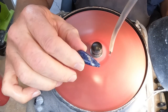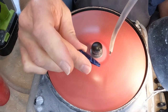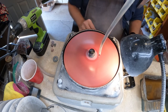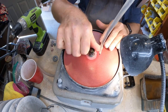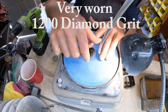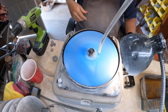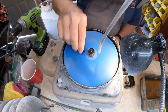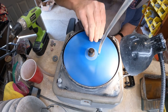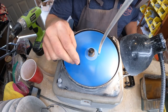And then I'll remove all the scratches. There's a whole lot of evaluating going on here, just making sure that I haven't missed any spots. Now we're going to move to one of the polishing stages. This is a 1200 grit disc and it's worn also, but it still does a good job polishing. I started out with the water at a little higher level just to make sure I washed any grit off the disc that may have been present from a previous operation, then slowed it down.